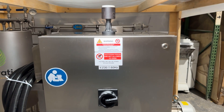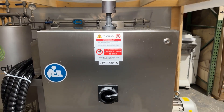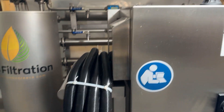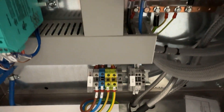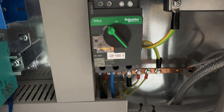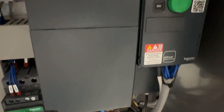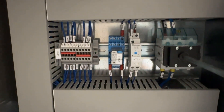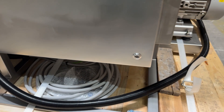This part here is just the control box. This box would sit outside of the C1D1 environment. This is just your main on/off — simple like that. And of course it has plenty of hoses so you can connect to the actual skid with the membranes. You need a qualified electrician with experience in explosion-proof installations and environments to connect this correctly, but all of the wire that you need is included — plenty of length to get you connected to your booth and to your electrical outlet.